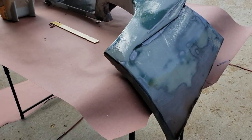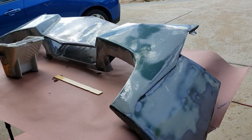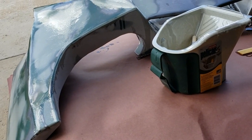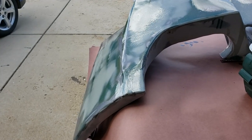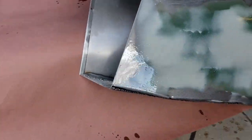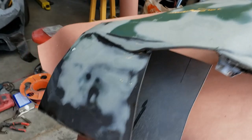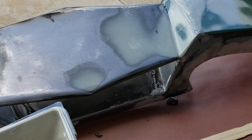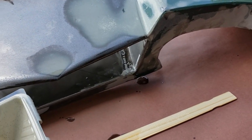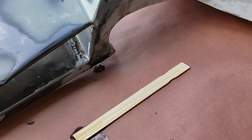Now since we're doing this in stages, we've got our epoxy on. What we're going to do is put a layer of carbon fiber on the top and just get the flat areas. Then after we've done that, we'll put some tape on the carbon fiber, cut it where needed, bend it, put some epoxy on the edges, and then bend it around and tape it onto the back. You don't want a lot of drips and runs on the edges that you're going to be pulling the carbon fiber over or else you're going to get bumps on those edges. So just try to keep control of all your drips and keep a nice even coat. We'll go ahead and let this get tacky, which should be in about an hour or so since this is a fast cure, and then we'll put the carbon fiber on. Stay tuned for that.